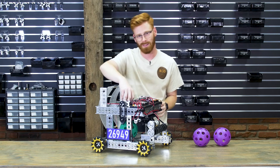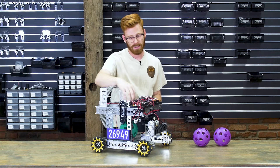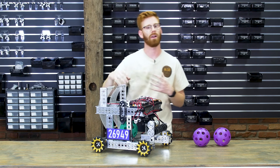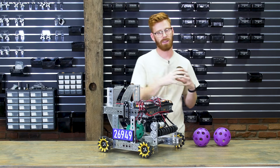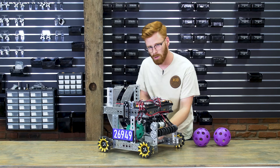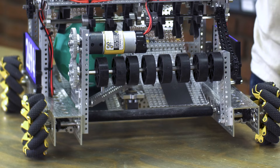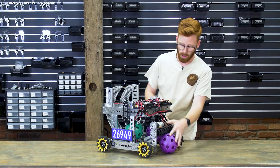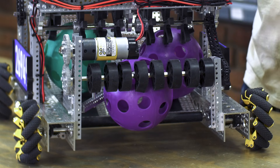Stopping artifacts from going directly into the launcher are two 96mm boot wheels per side, each driven independently by their own super speed servo. It's important this stage is independent for each side so we have control over which color elements to fire — otherwise we can't build the motifs, which is the big goal of this robot. Once you've collected the first ball into either the left or right side of the scoring mechanism, a torque servo with a u-beam diverter rotates over so the following artifacts can be collected into the other side. Our third artifact will feed into the same side as the second artifact selected, so typically you grab one and then two more of a different color.